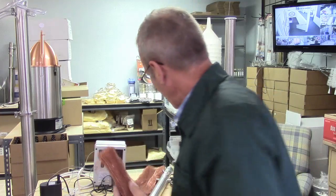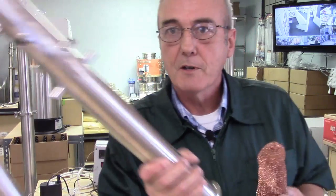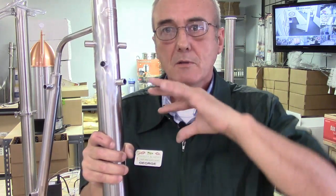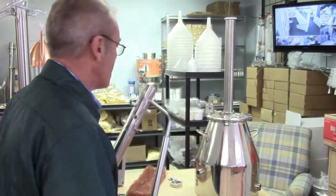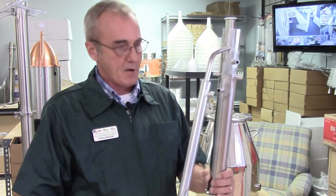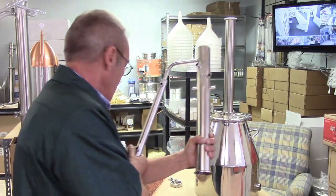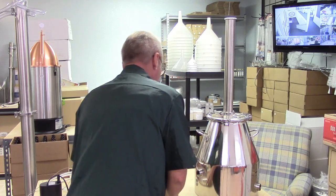In this case I've got a reflux still with the equivalent of two plates — I just put two rolls of copper in there. You do increase plate value when you start adding marbles and other media. But don't go crazy — this is not hard but don't use 'GI math': if two plates are good, ten ought to really get it done. No — now you're getting to ludicrous and you're going to stop it up and cause a dangerous reaction.